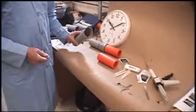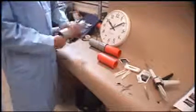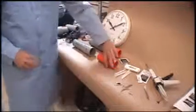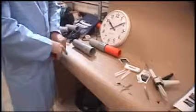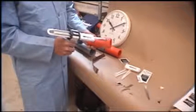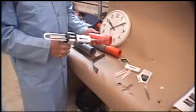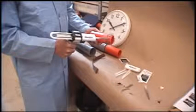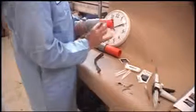You can also use the bell end of the PVC or a flared end — these actually make life a lot easier. All we need to do is rough off the inside of the bell end or flared end, and sand the polyethylene. Now we're ready to apply the Bonduit. The Bonduit will last about four minutes before you have to throw away the tip, so you can use the tips for more than one coupling if you get everything prepared ahead of time. You can just slide it in, twisting it a little bit as you're pushing it in. Make it smooth on the ends just to make it look nice. And that one's all done — that's a lot quicker than the flared end method.